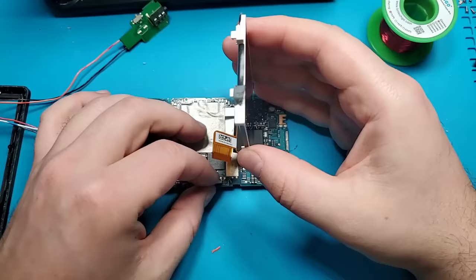It looks like the regulator is not putting out enough voltage as it is. That explains why the Bluetooth module hasn't turned on yet. I'll need to adjust the small potentiometer until the reading on the multimeter is very close to 5 volts. After setting the voltage output, the Bluetooth module powers on.